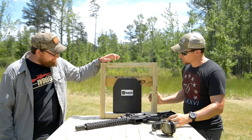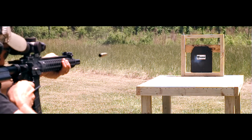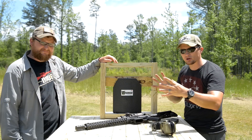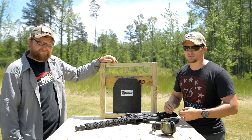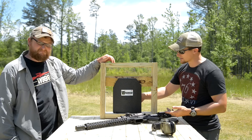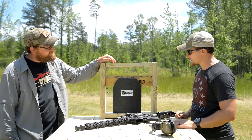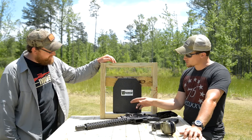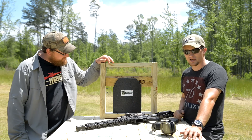The round hit just low of center and the anti-spalling coating captured the entire projectile. Now that's a solid brass projectile, so upon impact it's meant to break apart when hitting a hard target like this — on soft targets it keeps punching through. We've got a little bit of a bulge on the rear of the plate. This is about a quarter inch thick AR-500 plate with anti-spalling coating on both sides — pretty impressive, just the amount of energy that round hit the plate with. We're going to proceed to pelt the crap out of this thing, hit the same place over and over, and see if we can get the anti-spalling coating to break apart.